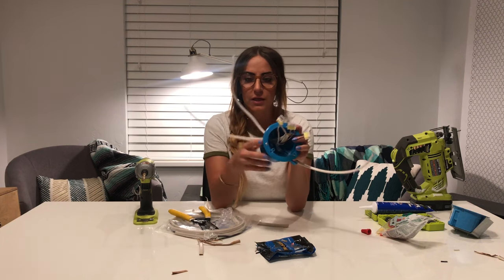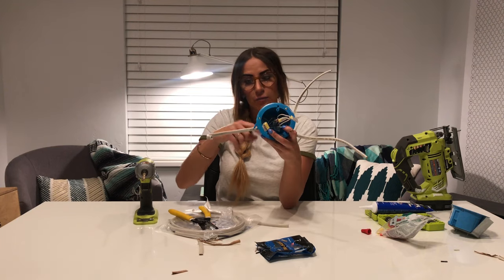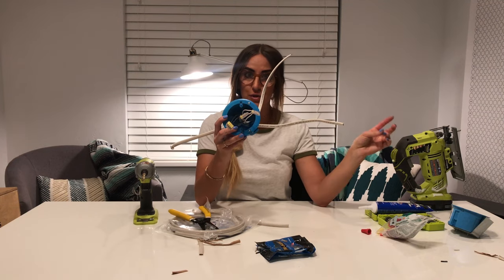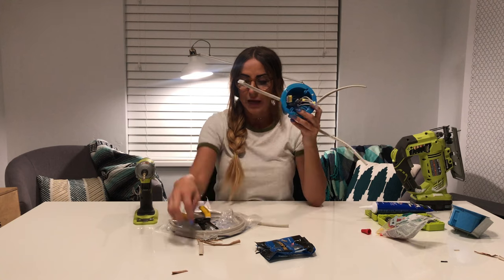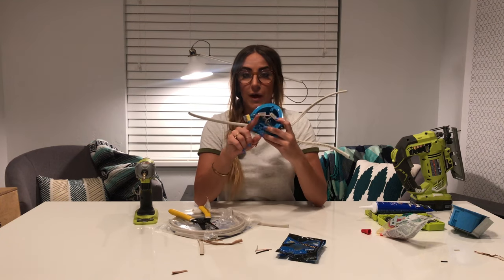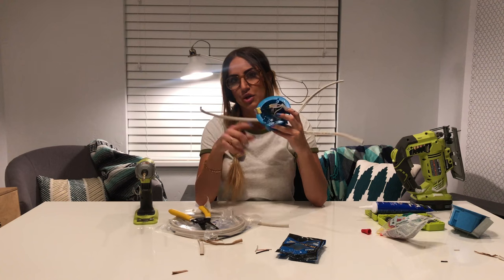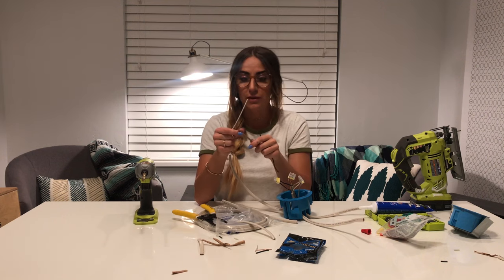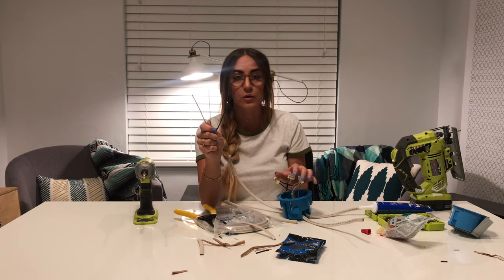So this is about what your light will look like. One of these wires is going to your electricity, you've added one that will go through to one of your lights, and you've added another one that will go to your third light. The last thing you need is a Romex cord that will connect to the existing light fixture — a short one that will attach to each of these three wire connectors and feed right back out to your light fixture to give it power.